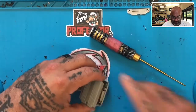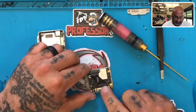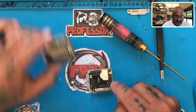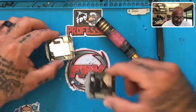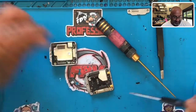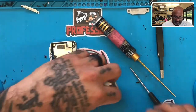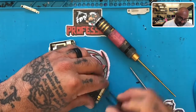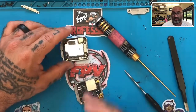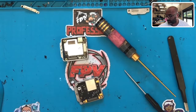So here's what I'm going to do. I'm going to open this up and take my tweezers to the flat end and pop this cable right off. There's my data cable right here. You have a label on here that says RF and the other one says BB. The BB goes to the top board and the RF stays on the bottom board — sorry, opposite: RF goes to the top board. I'm going to take this off because I have seen this happen with cables. There just seems something off with this unit.